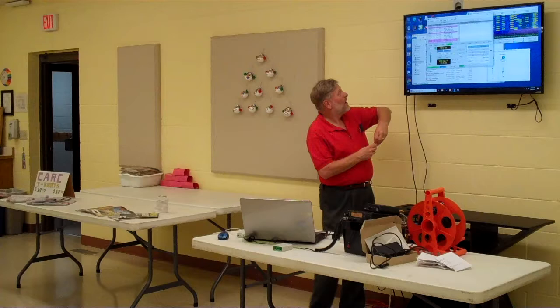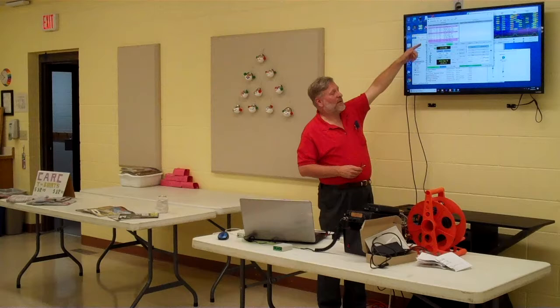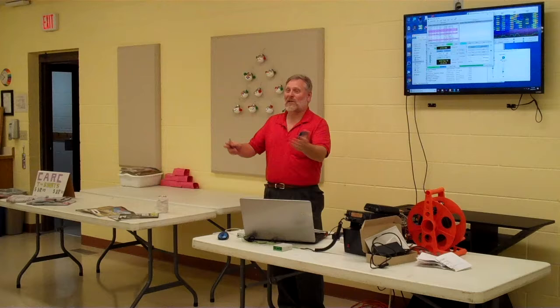The other nice thing with FT8 call is you can change colors for different things that are happening. For example, CQ will show up for this one. The default color is a light purple. But it also looks at its own log, the WSJT log. And if it's a new country, it's dark purple. So it's telling you, not only is this guy calling CQ, but he's a country you haven't worked before. So that's how people are getting their DXCC in a weekend.